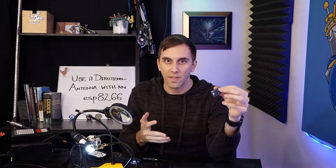To do this, we're going to need a couple things. One, I recommend a station to hold onto this so you don't burn yourself in the process. Two, a pair of tweezers so you can move the part necessary just a little bit. And three, some sort of hot air gun in order to heat up the solder so that we can move it without burning the board. You can try to do this with a really tiny tweezers and a soldering iron, but it is really difficult because it tends to get stuck to the soldering iron. So I recommend a hot air gun, although as you're about to see, it is a little bit difficult.